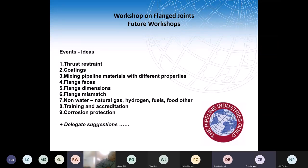I do think though that if a flange is subject to a bending moment caused by cyclic loading from a pump kicking in and out, then over years that strain and stress on the flange could lead to a failure. Yeah, but it is rare, I must say, but it can happen. I do know instances where flanges have failed as a result of fatigue.